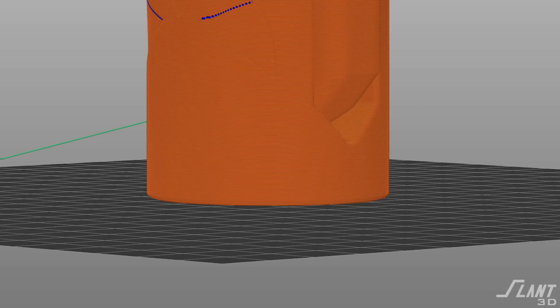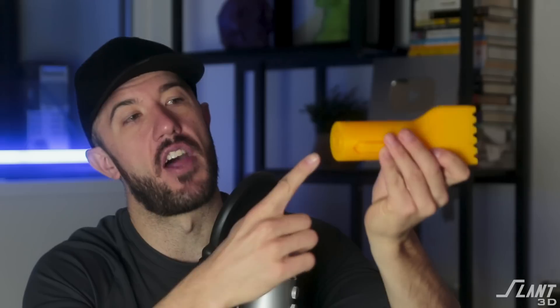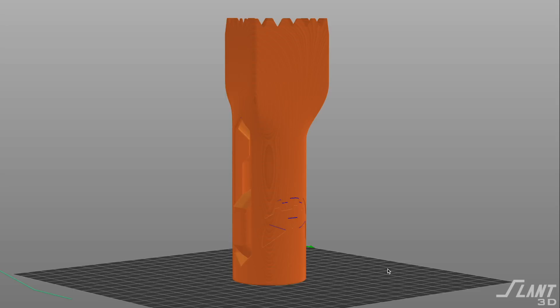This is the magic of FDM — you pull it straight off the machine with no post-processing, no refinement; it goes right into a box and it's done. As for subtle design details: on the bottom, make sure you have a little chamfer around the outside of all the edges. Otherwise the outer edge could blend together due to elephant's foot if those tolerances are too tight. Put a little chamfer on there and it eliminates that issue entirely.